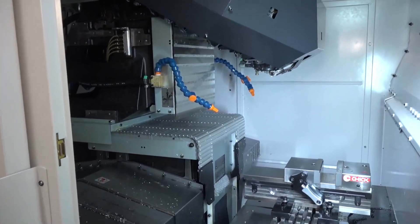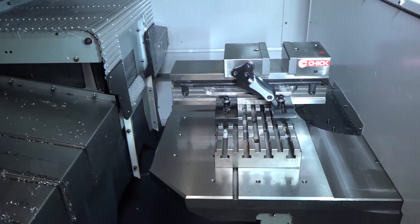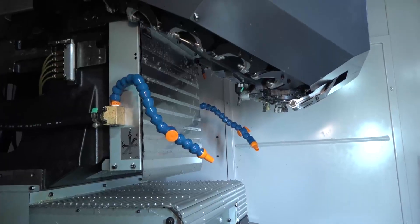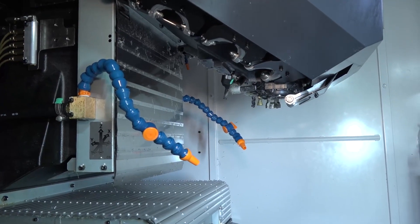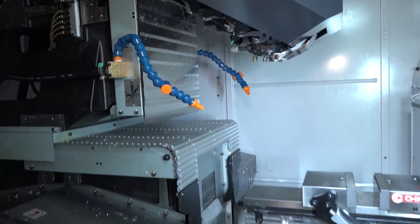Looking at the statistics of the machine: the X axis travel is 650mm and the Y axis is 400mm. You've got a turning diameter of 1,250 millimeters. The machine has a 16,000 RPM spindle and 22 tools. It's a BBT machine — big plus spindle face to taper — giving you machining rigidity and stability from this tool mount.